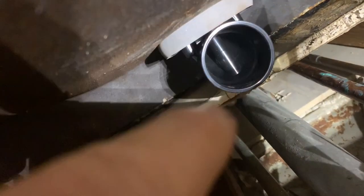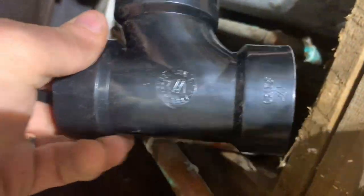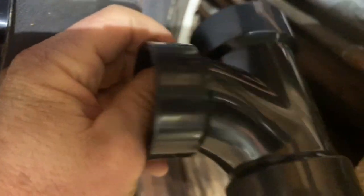As you can see, we've secured the lower part of the drain and now the upper part, which is the overflow. You can see the screw going right through it at the top. Now that we've got the upper and lower drain secured, we're ready to put in what we call the santee, which is this fitting right here. You've got to be mindful — it has to go a certain way. The neck on this has to go like this, which is the flow of the drain. I've seen it installed backwards, pointing up — you want it to go down.